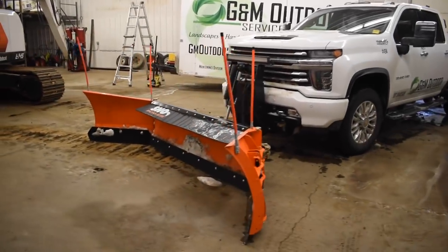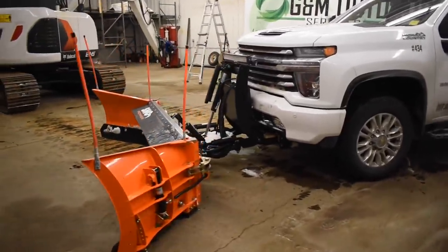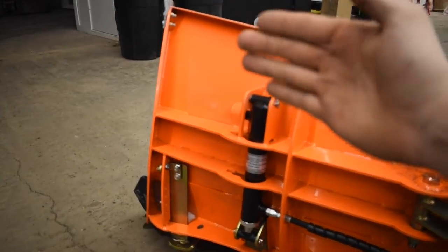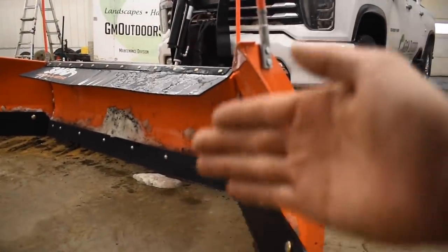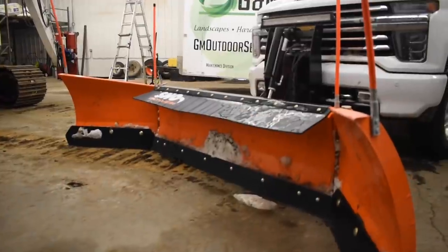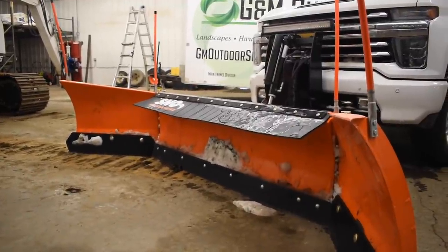What I like is that you can fit this thing anywhere and it scrapes really good. It's way wider and pushes way more snow than any Western wideout or V-plow hands down. It has a nitrogen cylinder on each wing, so when you hit something it's super smooth — it'll just gently come back and then go back out. Way smoother than springs, and I think a little less maintenance. People say the moldboard is too short and snow will come over, but that's nothing further from the truth. This thing is rolled, so it rolls snow like an arctic. I've had zero issues with any snow coming over the top.